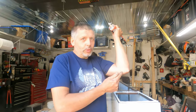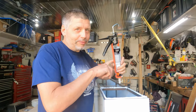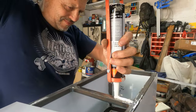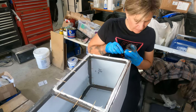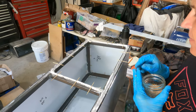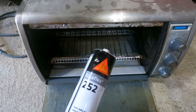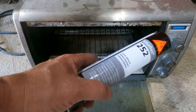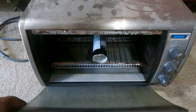You've got to watch the glue — and if anybody's ever going to do this, buy a battery-powered gun or some sort of power gun, because this is hard to do by hand. To make it a little bit easier to squeeze, I've been preheating the tubes at 150 degrees Fahrenheit for maybe 20 to 30 minutes, and that seems to make them a lot easier to squeeze.